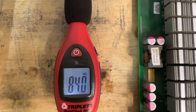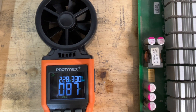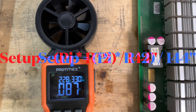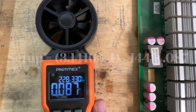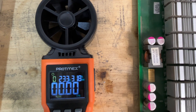For sound I used a simple dB meter — as you can see, the louder I talk the higher the dB. One of the most often missed things when using a CFM meter is understanding you have to adjust the area of what you're measuring. Knowing I'm using a 4-inch duct, I take the pi r² formula: pi times radius squared (r=2), so 4 times pi. Then I divide that into a square foot — 12 by 12 is 144 — giving roughly 0.087 square feet. Then I select cubic feet per minute in the unit settings and I can accurately measure at the exhaust.